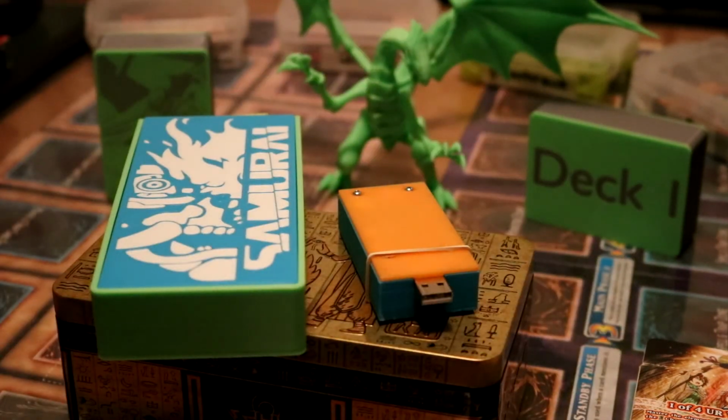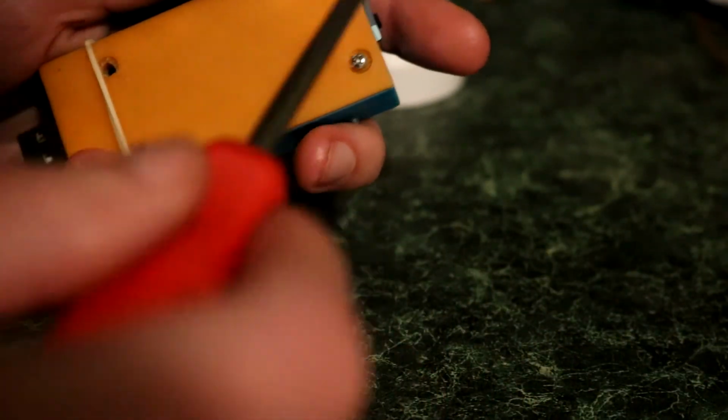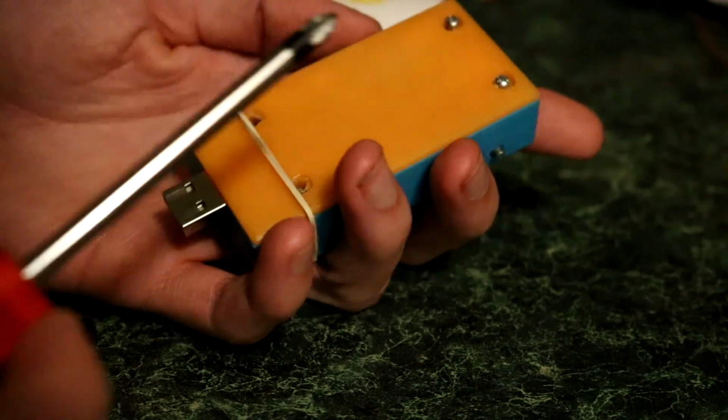In the end, the parts that I had available to make this were not the same as the ones that he had used. Like I said, I used a broken fake knockoff AirPods battery case charger. I took it apart and I realized the battery's small enough to fit in my new case, as well as the charger itself. So I looked up the battery name, got a new battery for that little AirPod charger thing, and I essentially hooked it back up to the charger and reverse engineered the circuit.